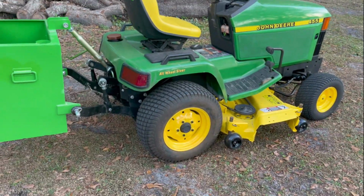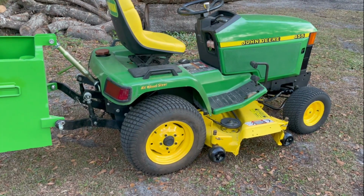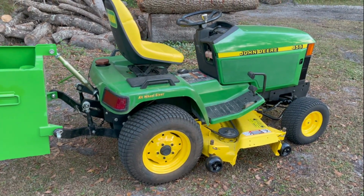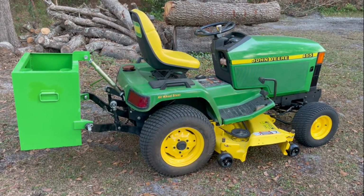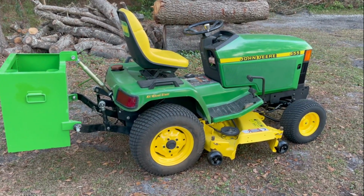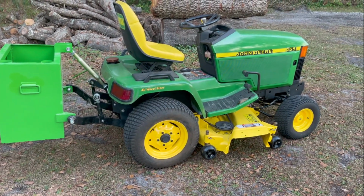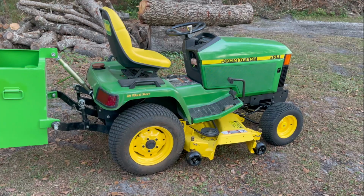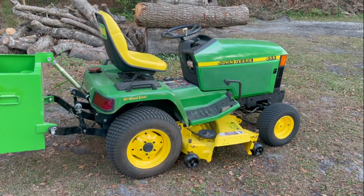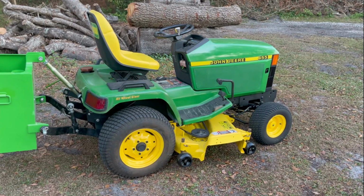And of course, with a 540 PTO, you could run a lot of different assortments of 3-point equipment that you couldn't with the old 2000 RPM rear PTO. That was limited to particular implements or attachments that were specific to running at 2000 RPM, which was basically only garden tractor stuff, and is actually pretty hard to find.